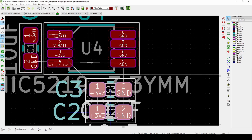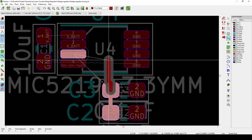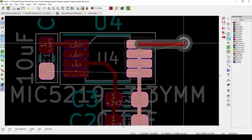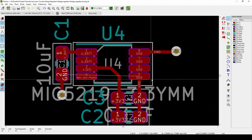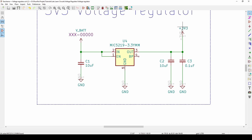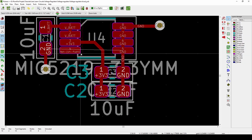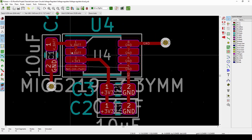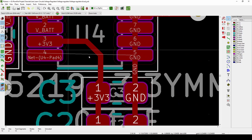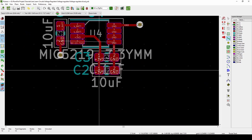It's not high current — 500 milliamps — so you don't need to worry too much about track thickness. Just make sure those decoupling capacitors are as close as possible to the IC. You can see I've got my ground, my 3.3V, my VBAT, and then I just route it — nothing very serious, nice and easy. I normally use a ground plane with vias. Pin 3 is the output for 3.3V, pin 4 is the bypass. Input is VBAT and output is 3.3V.